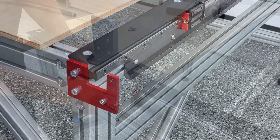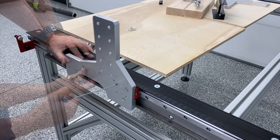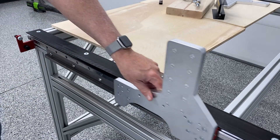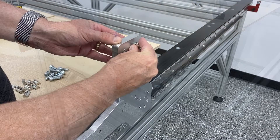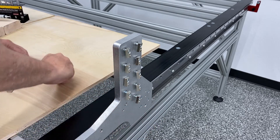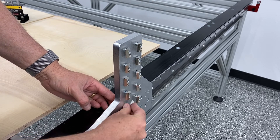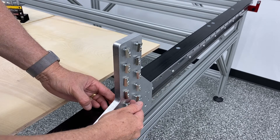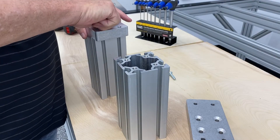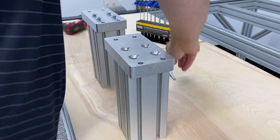The bumper plates also provide a cosmetic cleanup for the visible end of the extrusion, making it more appealing. And they provide a mount for the proximity sensor — the little piece of metal that the proximity sensor detects. Here I am putting the riser plate on, which takes eight bolts. I'm using roll-in T-nuts and bolts, a total of ten of them, which the riser extrusion is going to slide down on. You can see the configuration — they're all pointing down, with the exception of the bottom two, which you'll flip up as you slide the riser extension down.